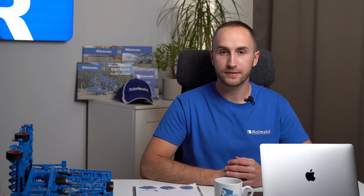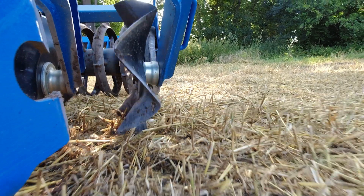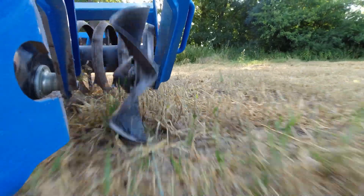On the other hand, the speed cutter disk harrow stands out primarily due to its new type of working element. The wavy disk was designed for ultra-shallow cultivation at 2–5 cm depth with speeds of up to 20 km per hour. The design of the disk arm was also modified, which in the new variant allows for utilization of all the advantages resulting from the use of the wavy disk, which replaced the traditional disk here.